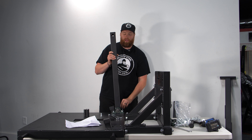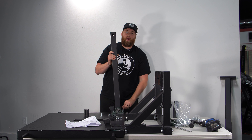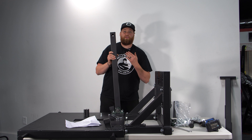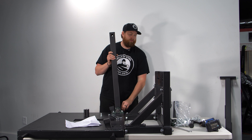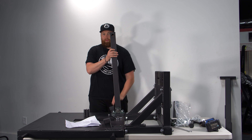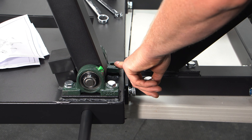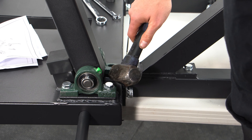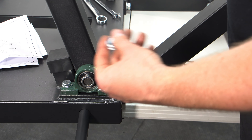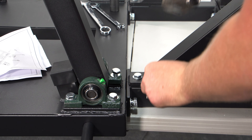You can always shift them in or out, left or right, and tap them with a hammer — they'll always go back in place. I highly recommend putting the top bolt in first, then tapping the bottom without the bolt in to get it aligned. Go ahead and rest it on the end once all are in. If still slightly misaligned, take the bottom, hit it with a hammer a couple of times, and now it's aligned — you can put the bolts in no problem.